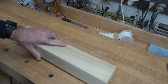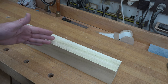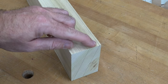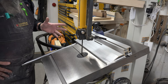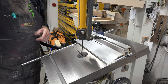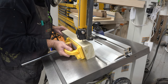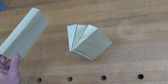The first thing we want to do is take this over to the bandsaw. We're going to tilt our tabletop anywhere between 18 and 20 degrees and cut some wedges out of this 2x4. You can see I've got them marked on one end — you want to leave on the smallest end at least one eighth of an inch of material. Depending on your bandsaw configuration, be careful when tilting that the top of your fence doesn't contact your blade. I had to put my fence down to low profile mode. Either way, we cut the wedge leaving at least one eighth of an inch at one end.